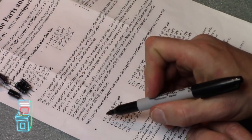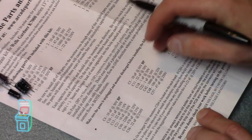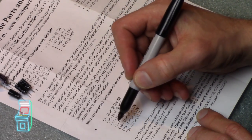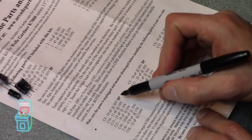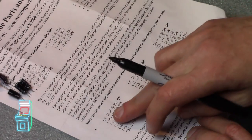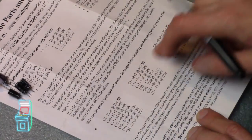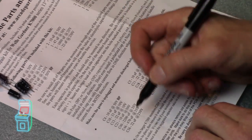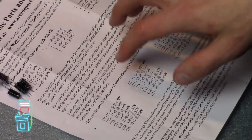You want to go across in numerical order - C4, C5, C6, C10. Originally when I had these kits I would go haphazardly down the list, but here they're kind of next to each other which gives you a clue. If there's C4, C5, C6, see these all use 10UF at 50 volts bipolar - those are the three you've got to replace. Just go across like that, it makes it way easier, and just put a dot next to it. Don't cross it out because it makes your life crazy later if you've got to go back.